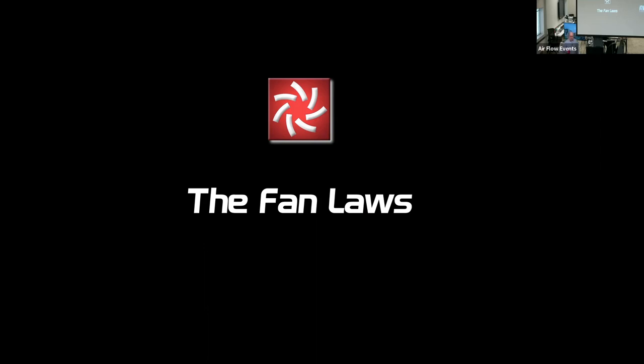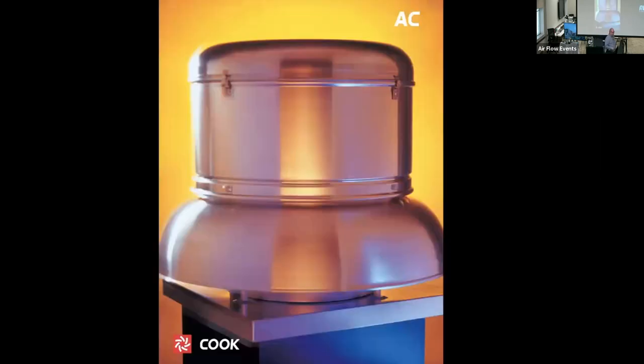So now we're going to get into one of the more challenging subjects, the fan laws. It's not as in-depth as we take it in the more advanced classes, but you're going to get put in the deeper part of the swimming pool right off the bat here. The reason this comes into play is it helps significantly if you're trying to get more performance out in the field, but it also explains where we get some of the performance from.